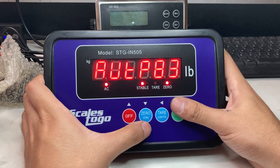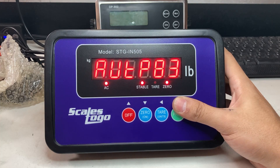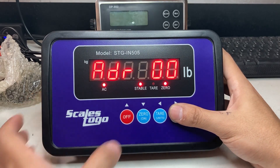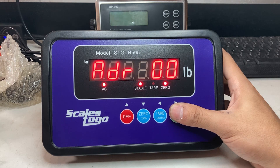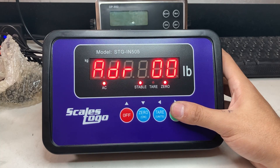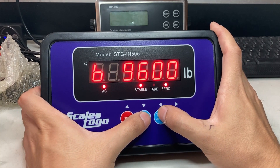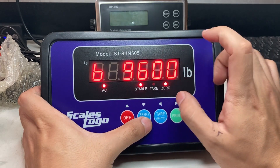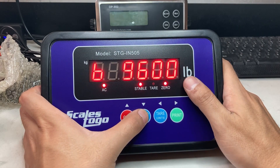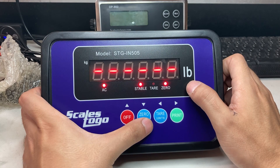AUT PA3 — that's the power off setting, so it's just not going to power off for 83 minutes, that's fine. ADR — ADR determines if it's continuous, so if you want the continuous output from the serial port. 00 means continuous. If you connect it to a computer, that won't matter. Baud 2400 — I could change this for baud rate for the serial port, the RS232 port, it'll work with our software — and zero is at the end.